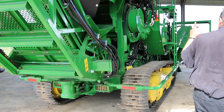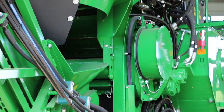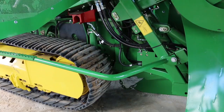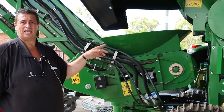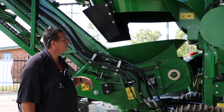Probably the main thing causing issues was that the reverse fan does automatically come on, but you can override that and put it on any time you wish. A couple of years ago we had flowers like you would not believe — rather than wait for the machine to do its automatic reverse cycle, watch your temperature gauge. If it gets into the red, hit the fan and watch the temperature gauge come down. If it doesn't come down after a while, at the end of your row get out of the cab and clean the screen, because nine times out of ten that is the issue — the operator didn't want to get out of the air-conditioned cab.